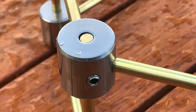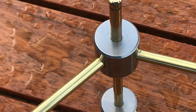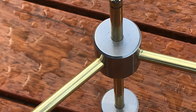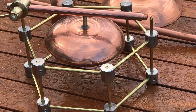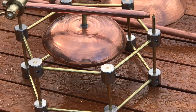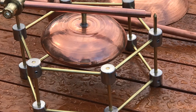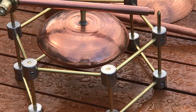I purchased those separately, and a couple of the nodes that are diagonally opposite each other are extra long for actually attaching the steam engine device. In the next slide the manifold pipe has been placed across between these two vertical bars and the boiler tank has been screwed into the bottom of this manifold.